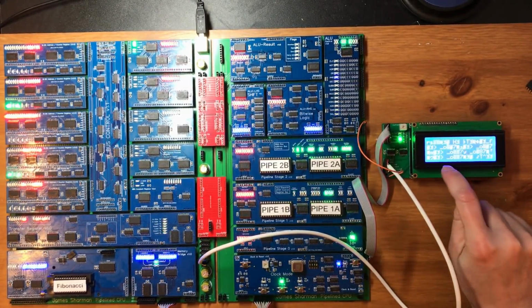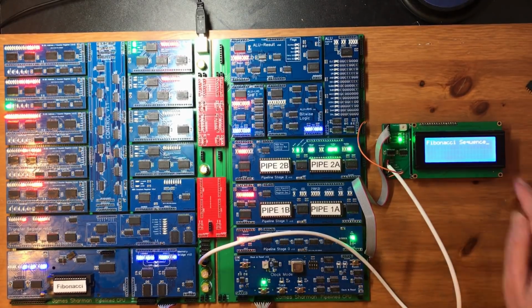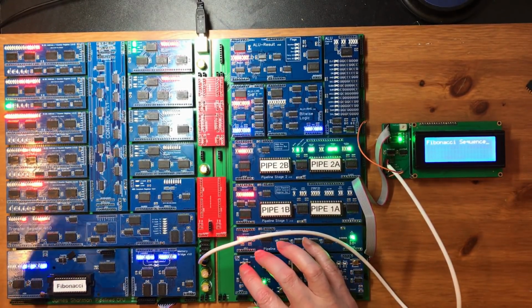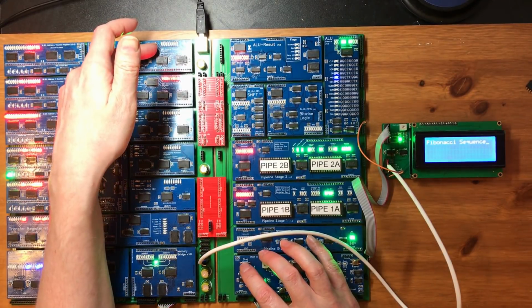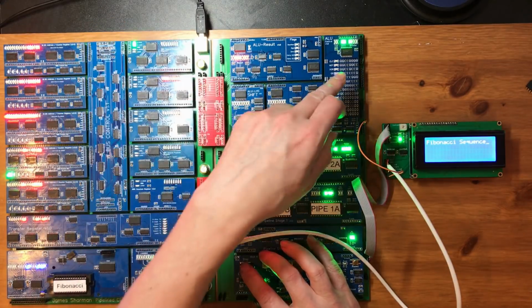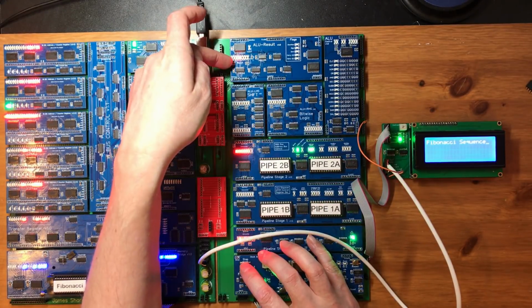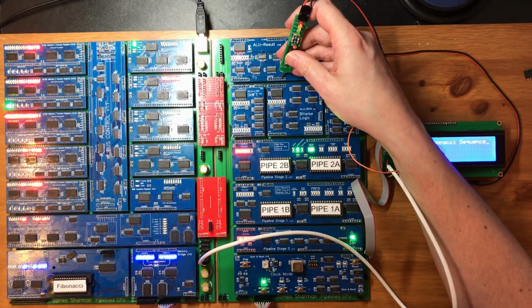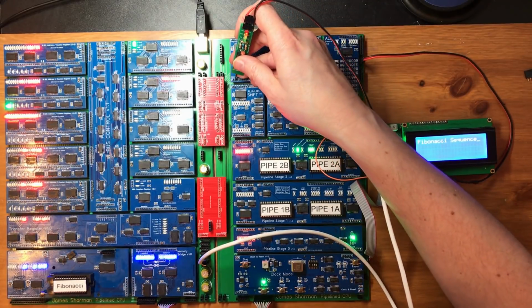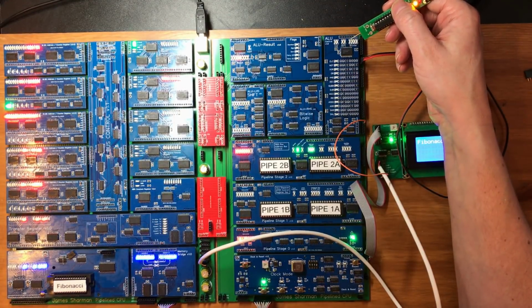Okay, that looks like the string print operation isn't working right. Okay, so we've written E out. Now the next thing that gets loaded in is going to be a 0, hopefully. I haven't got the assembly language in front of me. I think that just read the 0 in there. And that's performing an AND operation, so that's the test. It's outputting 2 zeros. That doesn't look like a 0 there. So expecting all the inputs to be 0, which they are, but then we're expecting the 0 flag to be set, which is what's going to modify the code action.